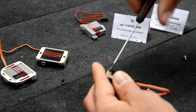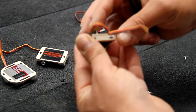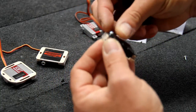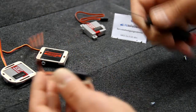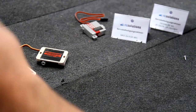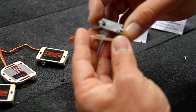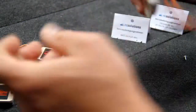Run the screws in and if you're using RC Solutions frames, be careful not to over-tighten. Just barely snug is all you need, especially if you're going to be taking these in and out a few times as you're setting up your model — you don't want to strip out the wood. Put them down top-side down so you don't rest the bonding surface on your workbench. Let's do this last KST servo and then we'll be ready to mount these into our wings.